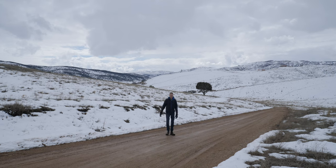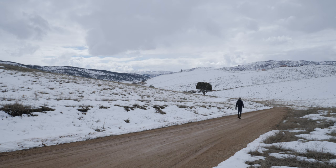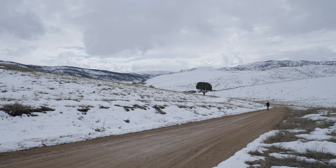In terms of transmission distance, when we went outdoors in the mountains of Utah with nothing nearby, we got our first dropout at 50 meters when the pack was not in line of sight. When it was in line of sight, we got around 70 meters. At 50 meters out of line of sight — for example, placing the pack on your back on the belt when facing the camera — is excellent. Compared to a lot of other digital systems we've used, that's one of the better results.